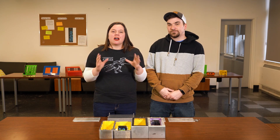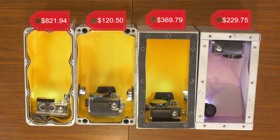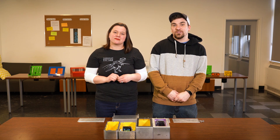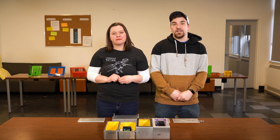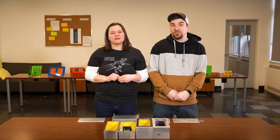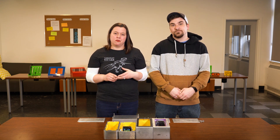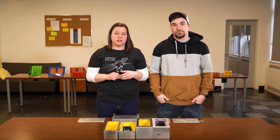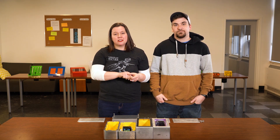At the top of the video we mentioned cost-effectiveness, so let's take a look at the quantity one pricing for each of these types of enclosures. After revisiting our hypothesis, we can clearly see that a custom watertight heavy duty die cast enclosure will provide sufficient resistance to liquid when submerged and will also be the most economical option, as this particular test enclosure costs the least without any custom hole cutouts. Keep in mind that these results would be much different once we have custom cutouts and NEMA-rated connectors. We also wouldn't necessarily get the same result for spray testing, so stay tuned — we're going to try doing a Proto-Experiment spray test for these enclosures in the future.